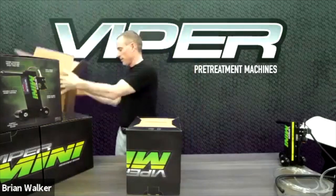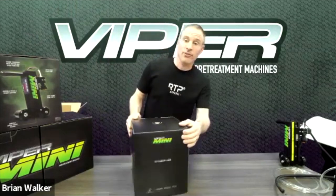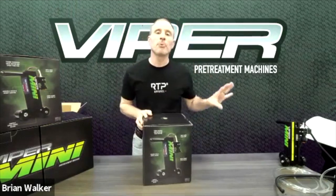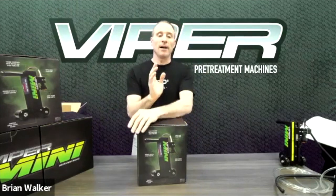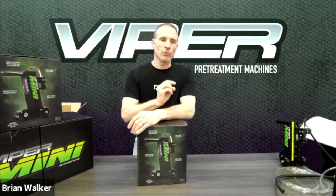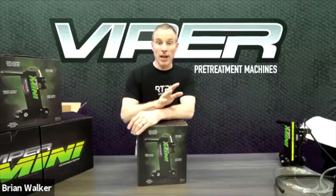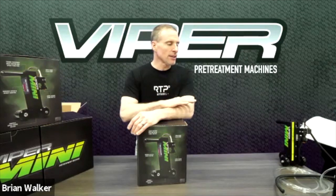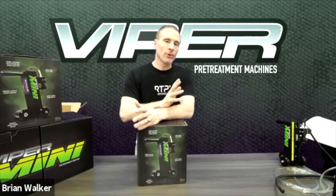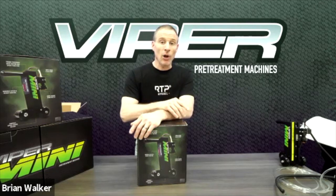Hey, Brian, we actually have one more question here. Do you have to clean it after every use? Yes. Cleaning of any pre-treat machine is highly recommended. You want to make sure that you do not leave the pre-treatment sit in the machine or in the nozzle tip area. It can gum it up, but I'll show you the clean out on this. It is super easy. You can do it literally within 30 to 45 seconds, less than a minute typically, because it does not take that long.